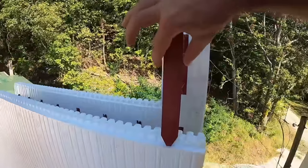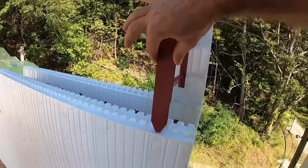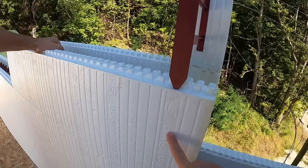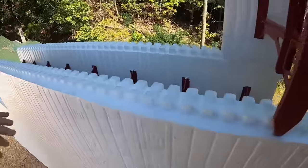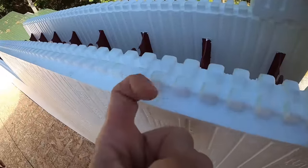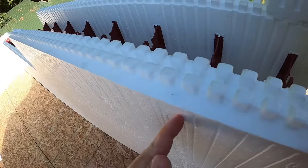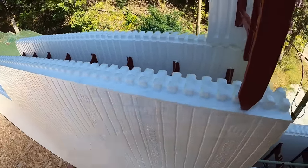So what he's explaining there is, what is this width? 1 1/4, yep. So this is 1 1/4 wide, and it comes down to essentially 3/8 of an inch. This stud down here is going to have that same taper. So when you cut through this to embed your electrical wire, imagine my finger's that electrical wire and it's not as long, but you tuck your wire into the ICF after you chainsaw a groove into the foam only.